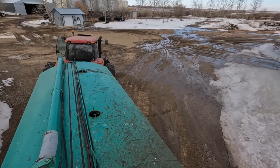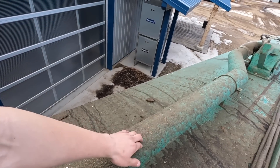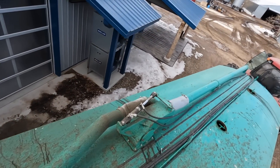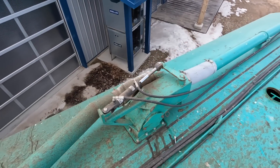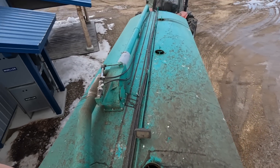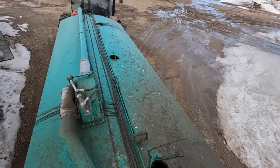We got her backed up to the water spout that we fill the feed wagon with — you can see it barely fits. That'll put a good amount of water in this tank. This is the actual pipe that pumps the manure from the PTO pump at the front over top of the tank and sprays it out the back. There's a valve here for recirculation — a hydraulic cylinder that switches a valve. Normally when you're emptying the tank it goes around, but this valve will divert it straight into the tank and agitate it up. There's a little bit of warmer water and stuff that's frozen in there, and hopefully any sand buildup will recirculate and clean itself out.